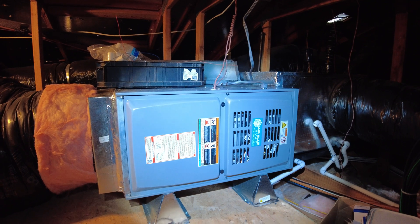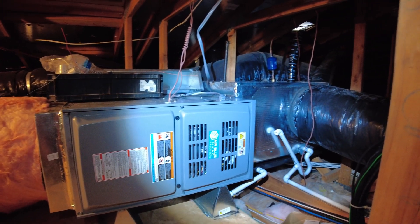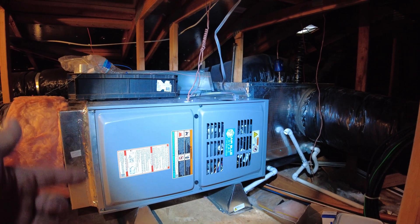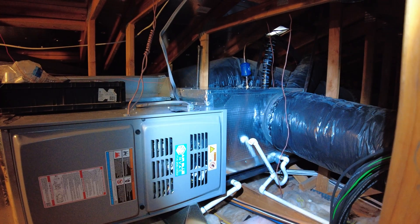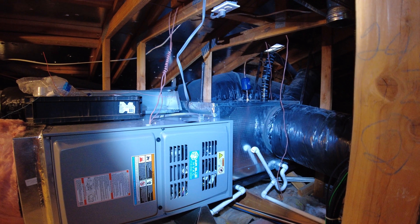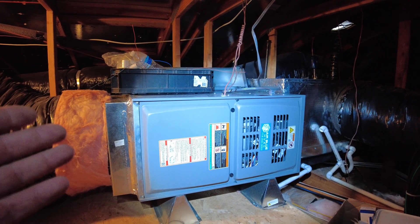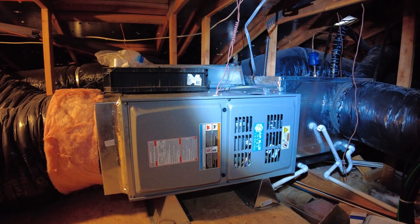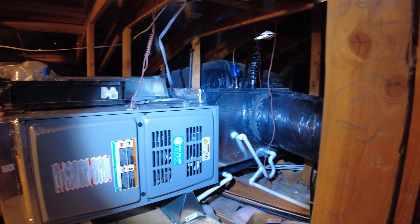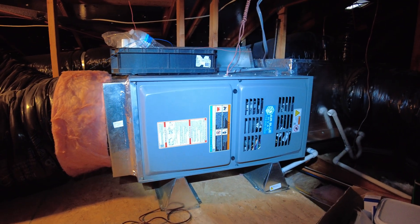As you can see, we didn't have to do any unnecessary modifications to replace the existing gas furnace and air conditioner with the heat pump unit, because technically these are the same units — we just swapped one for another. We changed furnace for furnace, evaporative coil for evaporative coil, and outer condenser for a new heat pump condenser. If you choose the proper equipment, you don't have to run an unnecessary 220 line to the new air handler or do any crazy modifications. It's a pretty easy retrofit job.